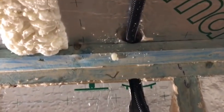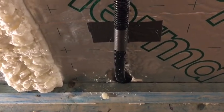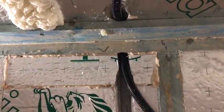As you can see, it goes up and above, and then right the way across to the centre. To the centre of the boat, there you go, look, if you can just see that. Okay, so there's our conduit now where the cables are going to be popping out for the lighting. This is the switch, of course. There you go, drill through there, and then I've just taped it to the ceiling just to stop it flopping about. And of course it goes through some more battening there, and then of course down the wall to the switch.